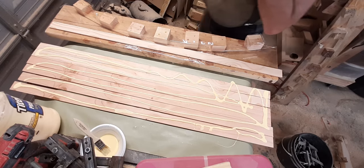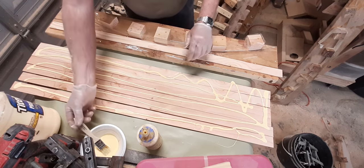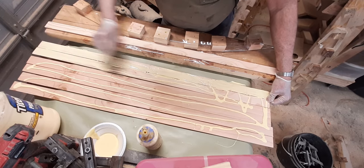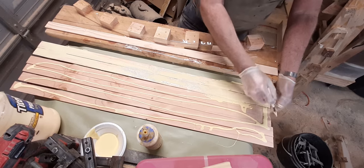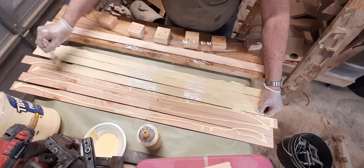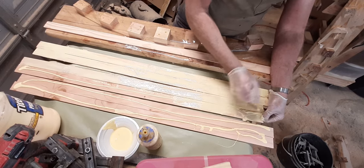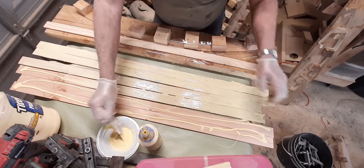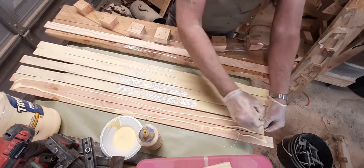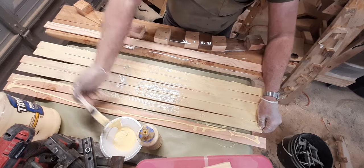Getting ready to glue up one of my heavy-duty rockers. I always cut them out in seven pieces, a quarter inch thick, then glue them together. I use homemade clamps made just for this — we pull them around a form and let them set overnight. This gives you a really strong rocker and you don't have the trouble of getting it perfectly radiused if you're cutting it from one solid piece. Doing it this way makes it about five times stronger than a regular piece of wood.